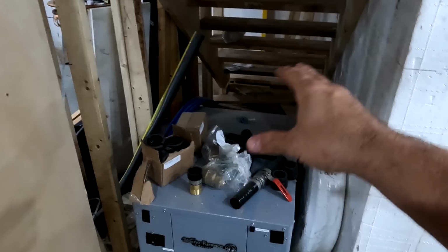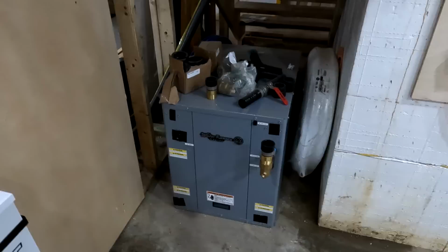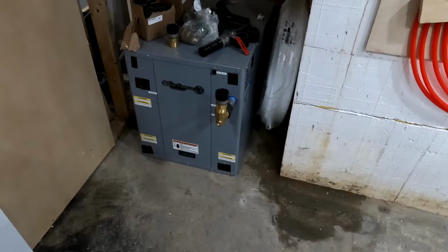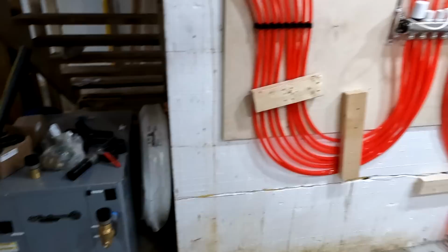I don't want any ductwork in my house. I don't want a system that's forced air like that. Another advantage to this is that it's set up for radiant heat. If you don't have a water-to-water system, you can't really use radiant heat. There might be a different way you can do it, where there's like a split system or something, but this is meant for water. So that's why I wanted to go with this system, because my heat is going to be radiant heat. That's the main heat.